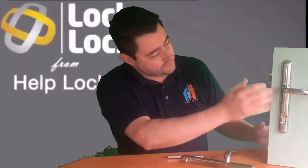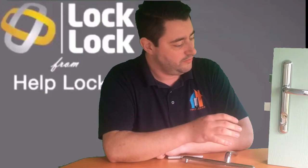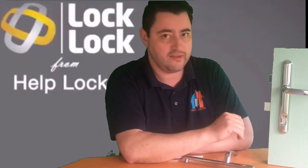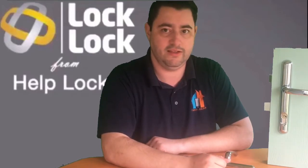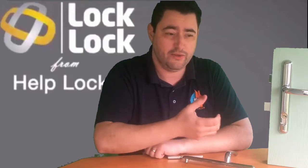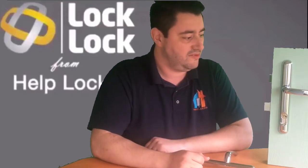The curved design, although it's extremely easy on the eye, is actually a security feature in itself. Ordinarily with a standard handle, what a would-be lock-snapping burglar would want to do would be to grip the handle, pull the handle away. Most of them tend to either bend or snap around here when they grip them, and then they set about going to work on the cylinder to bypass your door security and gain entry. This curved design means that they can't actually grip it. You cannot, with mole grips or any other tool, get any real purchase on this handle. Plus the fact it's heavier duty, the weight of it is far heavier than a standard handle, and we mentioned the screws being 20% thicker before.